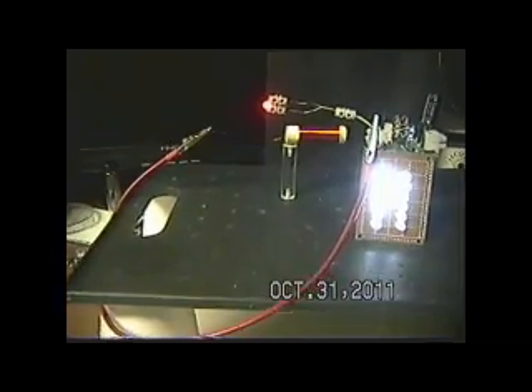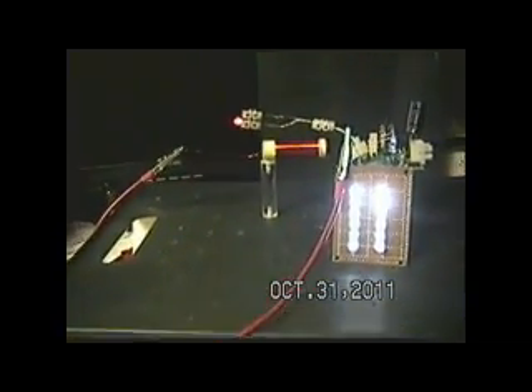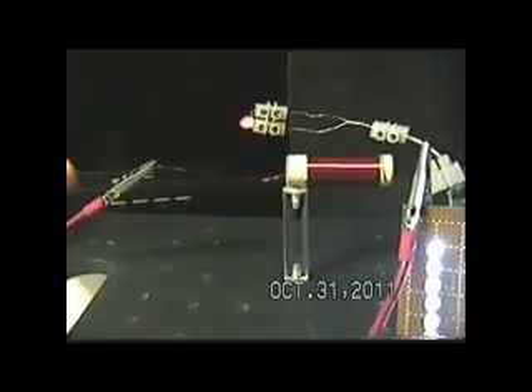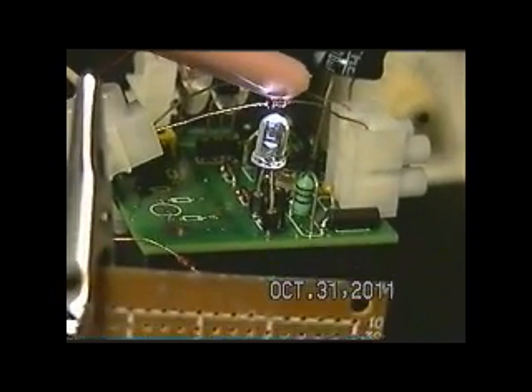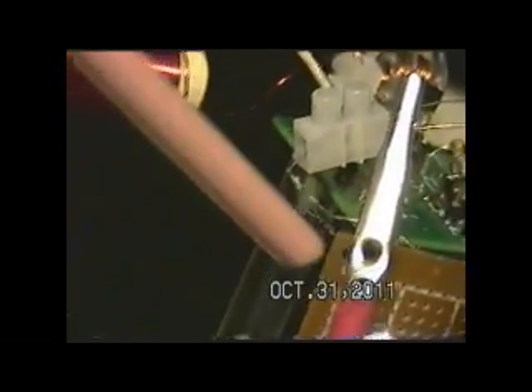I want to show you a little different variation of the PSEC. This one is using the full base emitter collector like a normal 18X. What it's doing is basically picking up a signal and charging this 1000 microfarad 50 volt rail capacitor, which is normally a 10 mic on the 18X. I'm feeding energy into there via this AV plug here which goes into the power rail. The tuning lead has one diode right over the top of it, and I come down here to another AV plug which is feeding this board.